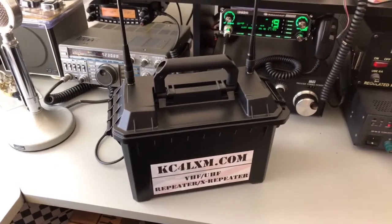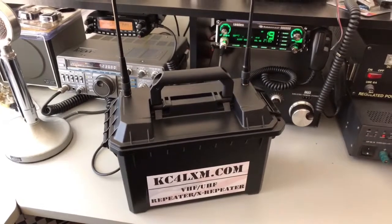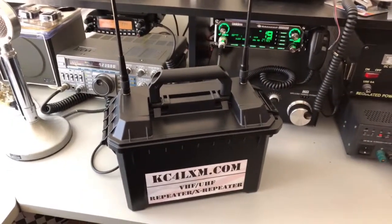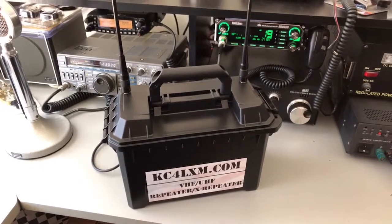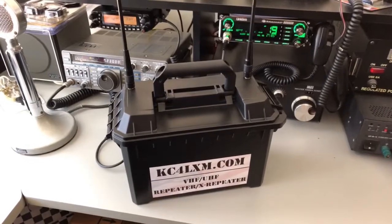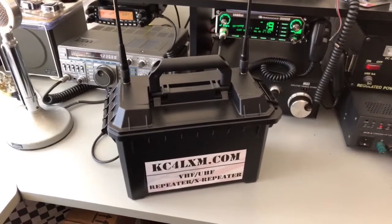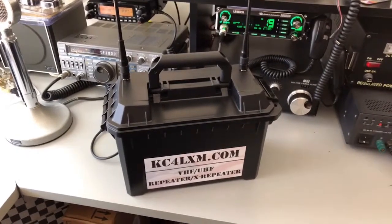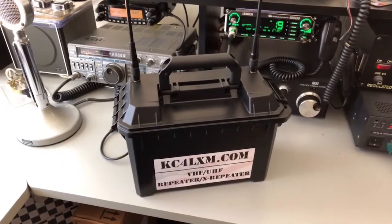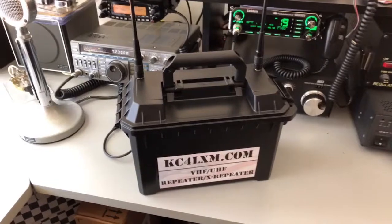You'll also need an ammo box, a couple of jumpers for the antennas, and a couple of antennas — in this case small rubber duck dual band antennas. Not a whole lot to put into it and you get a nice little unit out of it: a 1 watt or 4 watt at high power repeater unit. The basic operation of a repeater is to take one signal and repeat it out on another frequency in order to centralize communications.